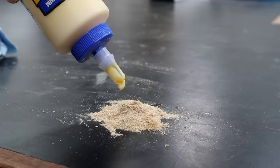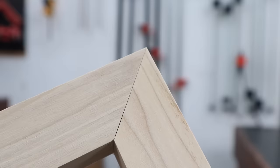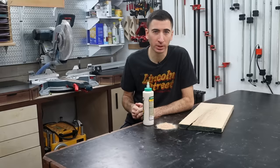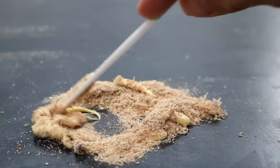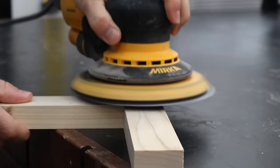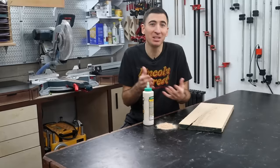Use wood glue and sawdust to fix mistakes in your projects. It doesn't matter what your skill level is, projects are going to go sideways. Gaps in between boards, joints that don't close up, or nature wins and you're stuck with wood that has a bunch of knot holes. The most common advice is to create a mixture of sawdust and glue to fill in those boo-boos. Even easier, you can just dab glue on the workpiece and unhook the dust collection to your sander and have at it. But does this work? Yes and no.